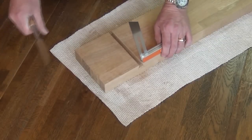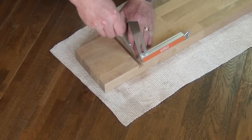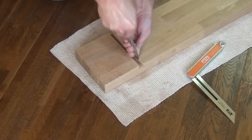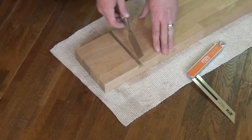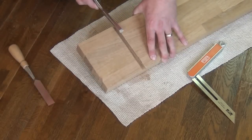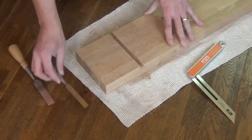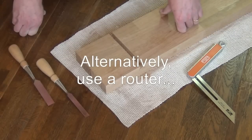To finish the clean up of the dovetail sides, use your bevel gauge still set to the dovetail angle, and some chisels. Line the chisel up with the angle on the bevel gauge, and applying pressure, just clean down the inside edge of your dovetail slot, repeating all the way along so you have a lovely neat slot. To clean out the very bottom of the dovetail slot, use a narrow bevel edge chisel working from both sides. Of course, you can cut these slots using a router — I'll show you that now.